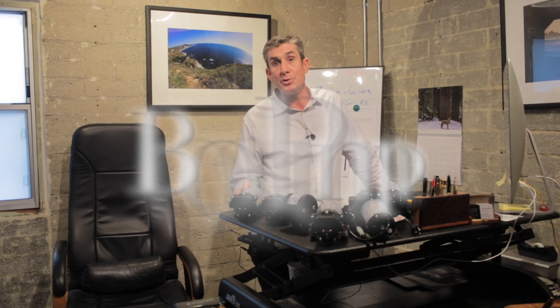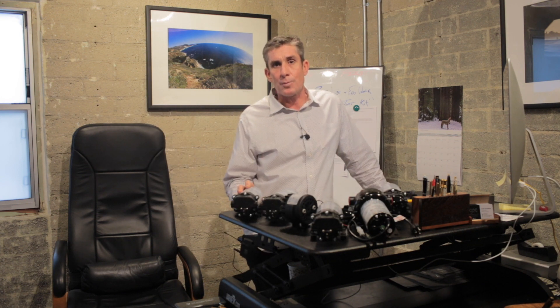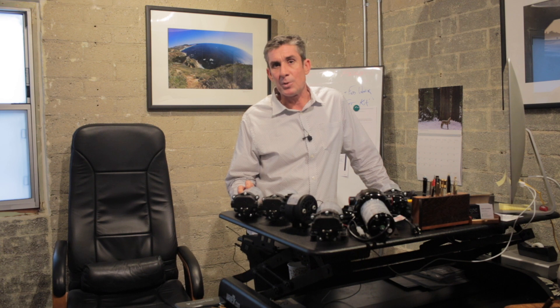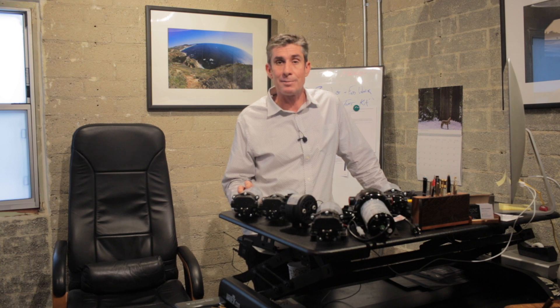The first group of pumps we're going to talk about today is what we like to call the boost pump. You're typically using this pump where you do not have significant water pressure to feed your source water to feed your membrane. So if your membrane is rated at 50 psi and you're running at 40, that's 20% less production — probably not your ideal scenario. It will work, but not ideal.